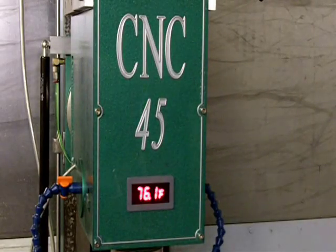A quick video to demonstrate the spindle bearing temperature gauge. Channel 1 is the upper bearing, channel 2 is the lower bearing. Right now we're running at about 8,000 RPM — it's only been running for 5-10 minutes, so it's just really beginning to warm a little bit.